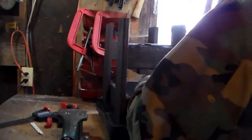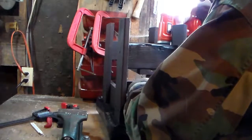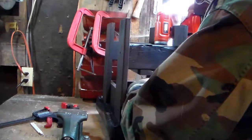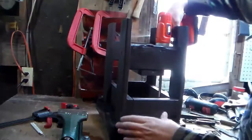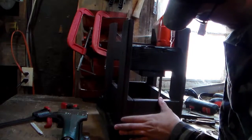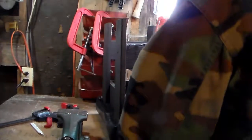The last step is just to attach the seat. I centered it on the stool and then used some wood screws to attach it to the 2 6-inch pieces that I installed in the top of the stool. There's a 1/2 inch piece of plywood on the bottom of these stool seats, so it actually worked out pretty good.